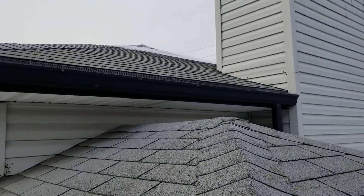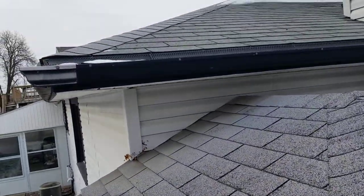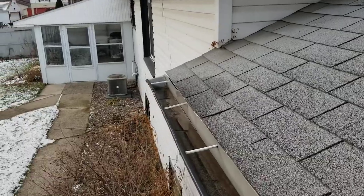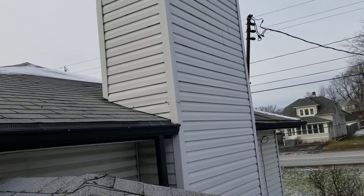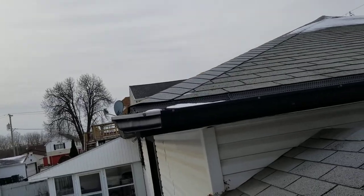It's too bad because we could have saved a big expense. Also, the gutters are going to have to be replaced with the roof because the gutters are on top of the drip edge instead of under it. When we go to tear the drip edge off, the gutters are going to come down with it. Plus, the spikes are pulling out and none of them are pitched right.